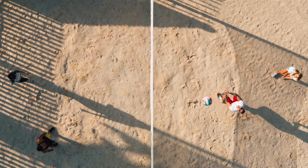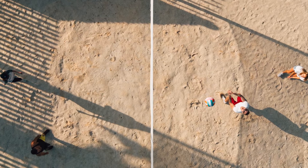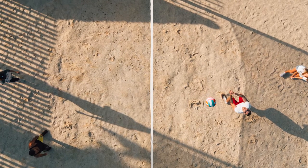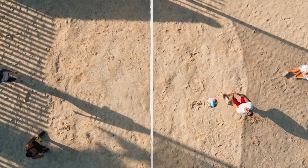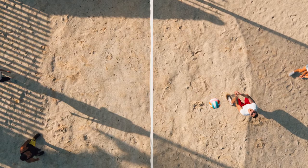Here on the Adriatic coast it was a bit of a challenge — there may be other parts of the world like Dubai where sand is more readily available. Our first attempt gave us quite a dark sand finish, and although it was fine-grained, it stuck to the feet a lot and gave a very dark finish the owner wasn't happy with. So while we used that as our baseline, we put another layer of more yellowish-white sand on top to create a genuine beach look. It was then hard-packed, which ended up being a more sensible approach for people running around on it. A lot of rain in the winter had to be considered, so we ended up with something white-yellow and more hard-packed than typical Atlantic soft sand, but it became a practical solution in the end.